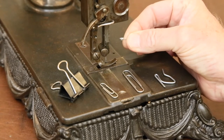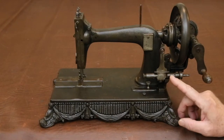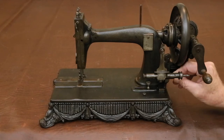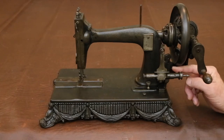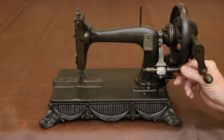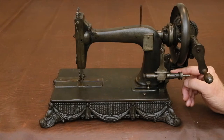This can also be used to make pigtail-type thread guides. The bobbin winder turned out to be an interesting problem. I had thought the issue was that the bolt was loose, but it wasn't — it was locked in tight and I had to use channel locks to actually unscrew it. What I found is that evidently sometime in its past the machine had been dropped, and the shaft to the bolt had actually gotten bent. I forced it out, put it in the vise, straightened it out, and now it works great. You never know what sorts of problems you're going to get into when you start a restoration or how you're going to solve them.